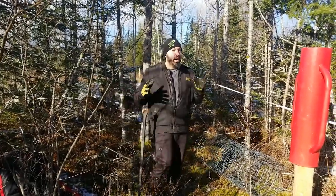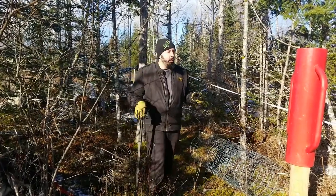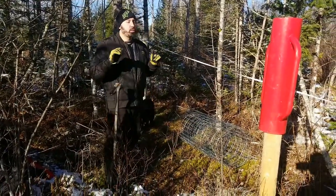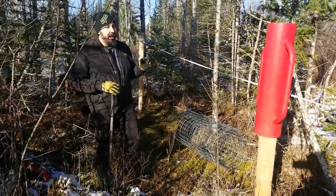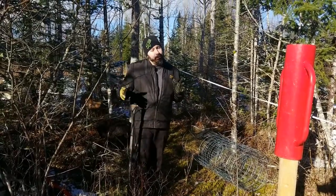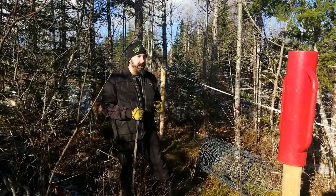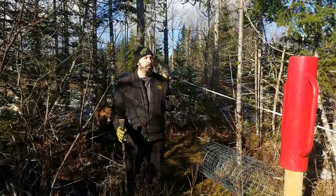We decided there's a lot of different ways you can do fencing. There's so many different types of fencing. The way we went with was this type of wire, 2x4 standard rolled fencing wire, and we use wooden posts. Now we're on really wet land, and so wooden posts, what we're doing with most of our farm options, is an economic way of going about it. This was the cheapest option. Steel posts of course will last longer, but we wanted to go with wooden posts for now.